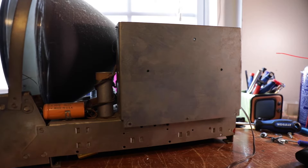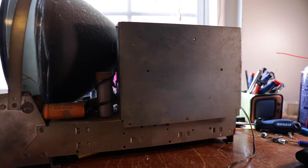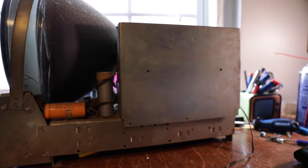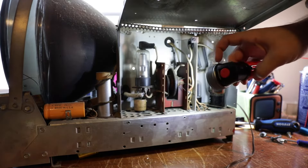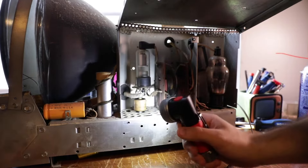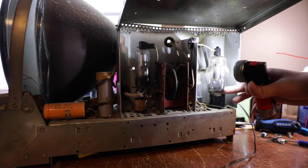It's the next day. I'm going to start poking around the set seeing what we've got. So this is a Sprague electrolytic replacement, 300 microfarad at 150. I'll have to check the schematic to see what that's supposed to be — this looks like a replacement maybe. There are a couple other electrolytics on the other side. Here's the high voltage section — the flyback actually looks pretty alright, and the high voltage rectifier has one of these 20k capacitors.